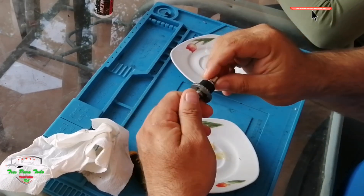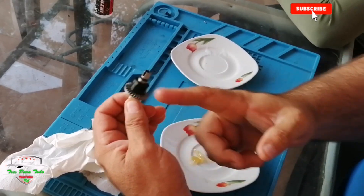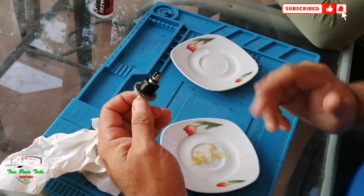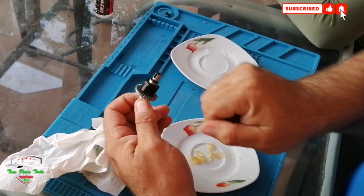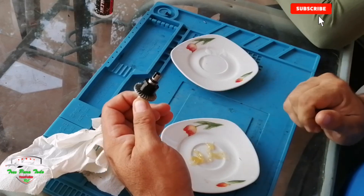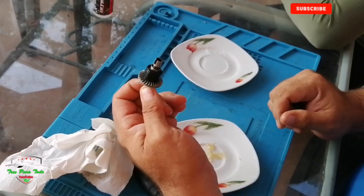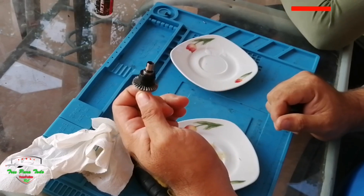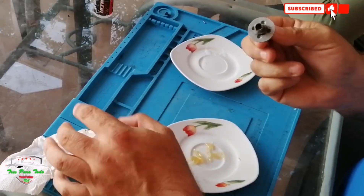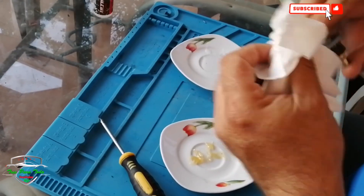The moment we have direct metal-on-metal friction, those teeth will be destroyed. For example, even with plastic — if you have 20, 30, 50 plastic knives cutting against it, simply through wear, friction, and temperature it will eventually cut through. The only way to avoid friction is lubrication. That requires a space filled with oil — which is why grease, unable to fill the cavity completely, is insufficient.